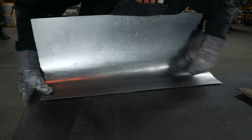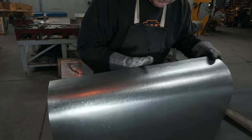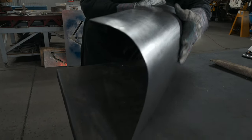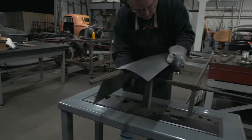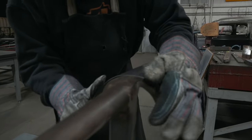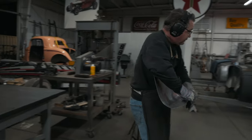This is our edge that needs to be flat, coming into our compound. Highlight lines look really good — no low spots, no high spots. I'm not changing any shape, I'm just changing the form. It's just back and forth until this thing fits the buck.